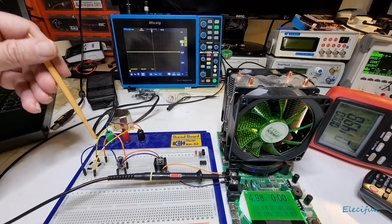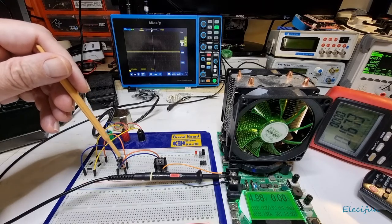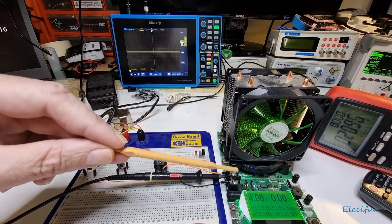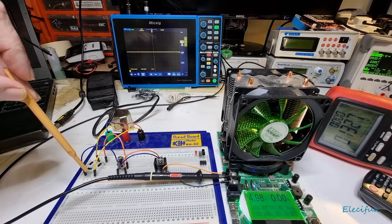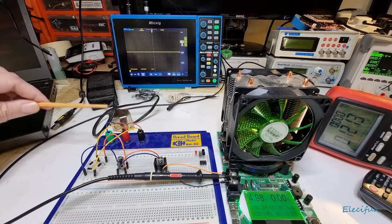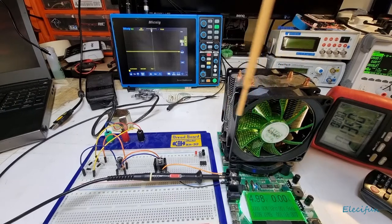So we've got our AC coming in on these two yellow wires. When it goes high, current flows through this wire, out along this positive wire, into the positive side of this capacitor, then out the positive side into the input of the voltage regulator, out of the regulator output through our DC load, back through here, back through this diode, and back to source. On the opposite half-cycle it uses the other two diodes — this happens 50 times a second at 50 Hertz.